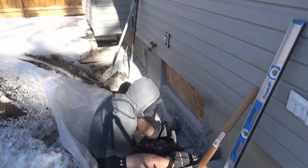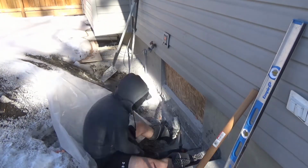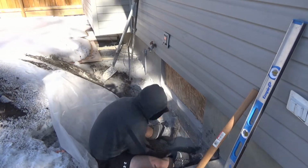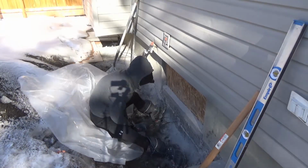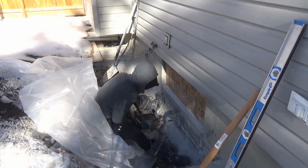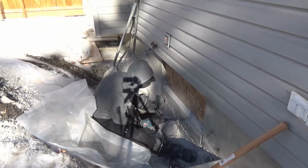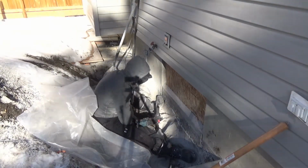So even if I cut one side, then went back inside to cut it again, and somehow managed to get them to line up perfectly, I still have 2 inches of uncut concrete in the middle with no good way to get at it. As you'll see later on, by drilling 3/4 inch holes all the way through, I was able to work a chisel bit in to get any missed pieces. I couldn't do that with a 1/8 inch cut.